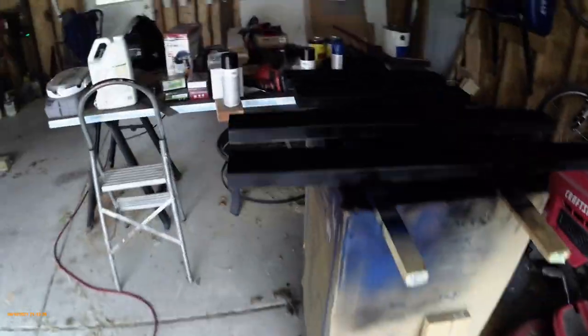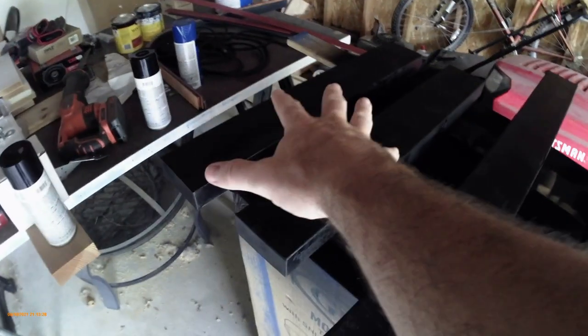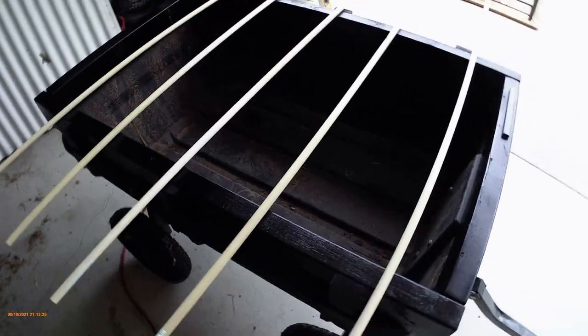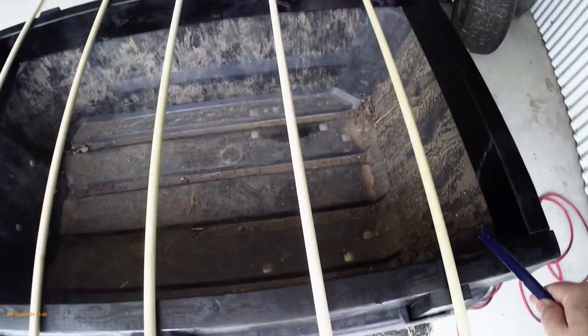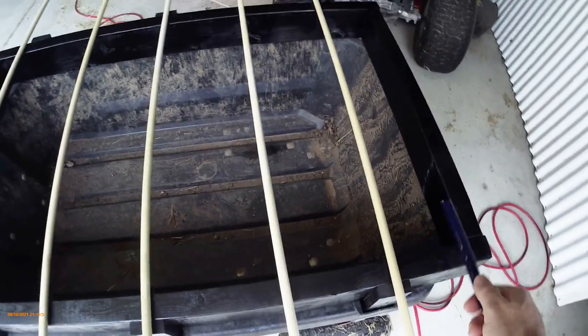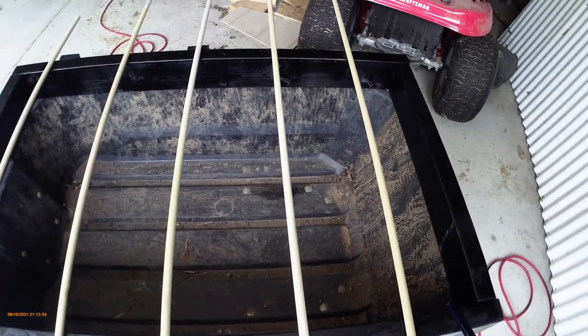And then here's the top row. Front, back, two sides. So what I'm going to do is measure from the inside here to the inside here, and I'm going to put a 2x3, because the 2x2s were all way curvy and stuff. They didn't have any good ones at Lowe's when I went last. So with a 2x3, I might have to take a little chunk of something. I don't think I have any 2x3s. All I've got is 8-footers, along with the boss lady.